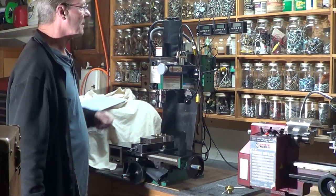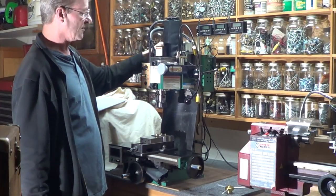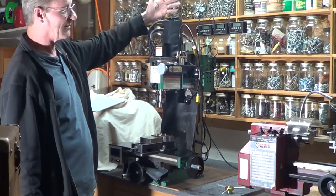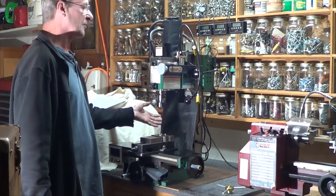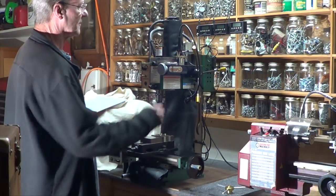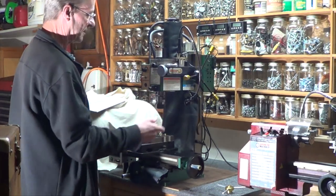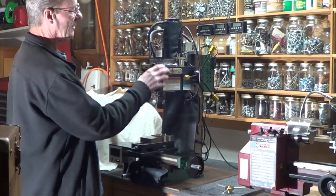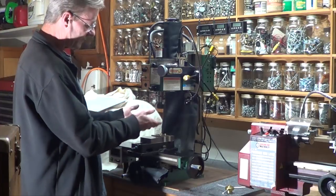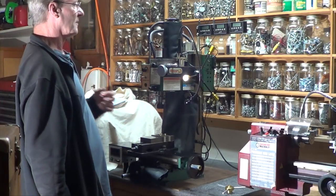The second thing is the pistons. I made my own — I know the Little Machine Shop sells the upgrade and I've got a video on that. But getting rid of that spring and using constant force pistons made a serious difference as far as being able to control it. When you're trying to play down at one thousandth of an inch, it just made a serious difference in using the machine.